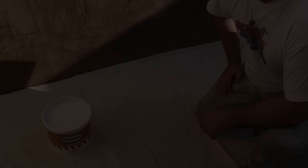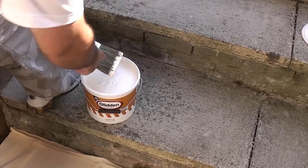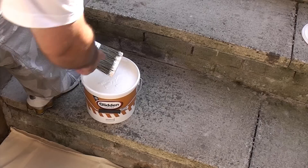You'll also notice we've put a dust sheet down — that's to stop any paint spills from going onto the actual floor. It's always a good idea to put something like this down when you're painting a wall. Whenever you're painting, you only need to keep the tip of your brush covered in paint. You don't want to dunk it straight in and have paint going everywhere, because if it comes down to the ferrule it's going to go all over the place. Keeping to about the tip makes the paint a lot easier to control, especially when cutting in on edges.